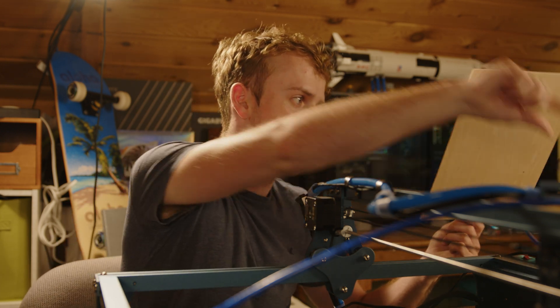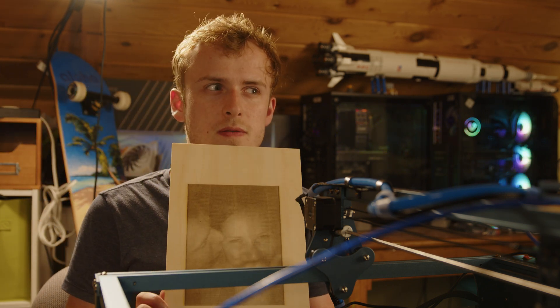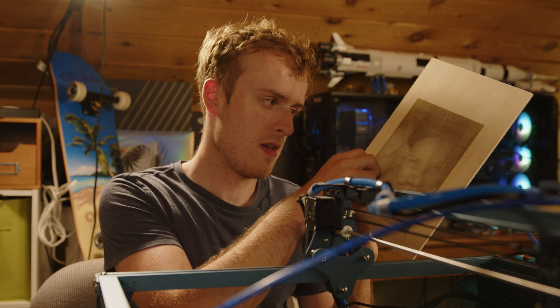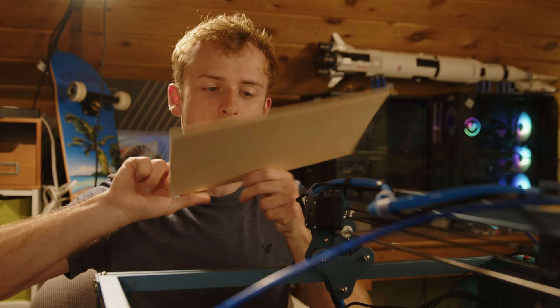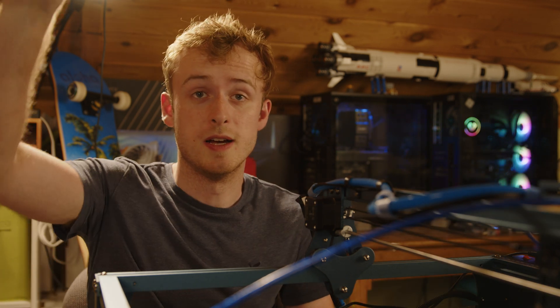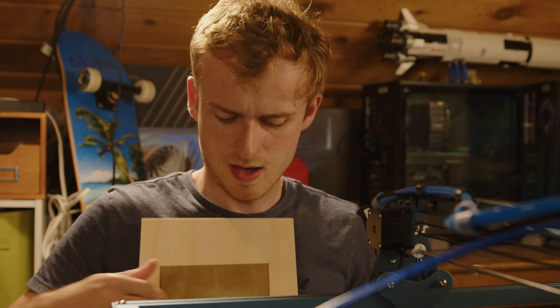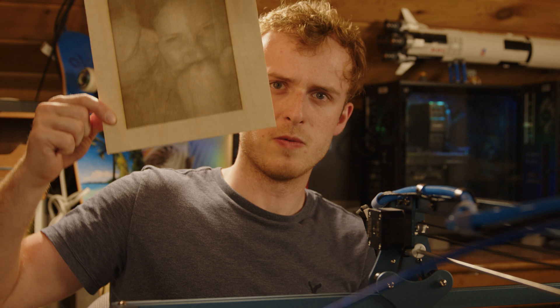I also engraved a picture of me and my girlfriend. This one was done at a little bit higher quality and faster speed at 100% laser strength — I believe around 400 or 4,000 millimeters per second. There's a little bit of surface marking but it definitely did not go as deep. Overall quality-wise it came out really nicely. I used Laser Grbl to do both of these, which is the simpler option. No major issues. You might notice one is slightly off-centered, but that was just because I didn't have it situated properly.